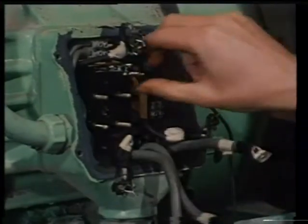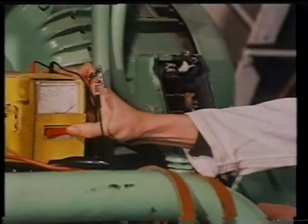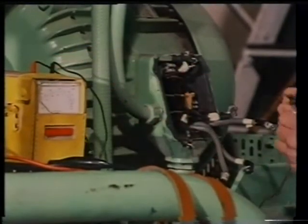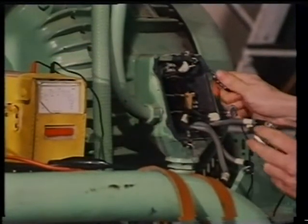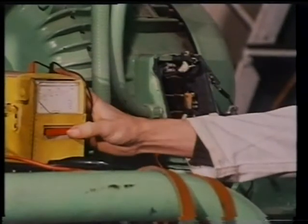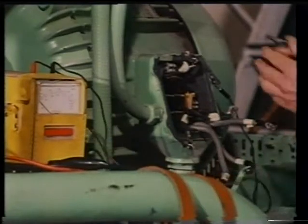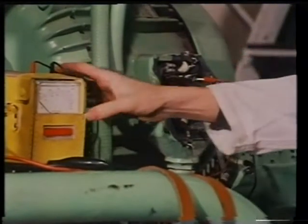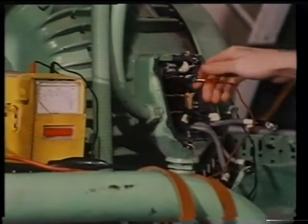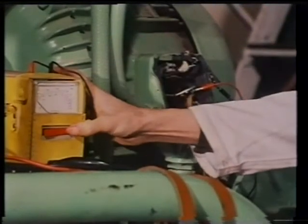Each time you test a part of the circuit to earth, check the insulation resistance tester first, with the probes together. Find 2 good earth points. And then test the circuit. First, the terminals to earth are checked.